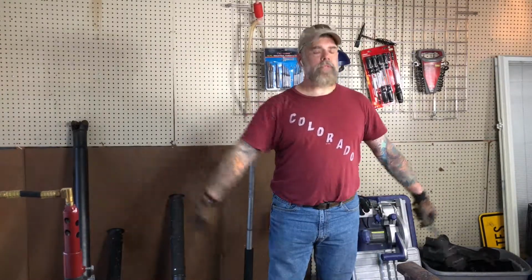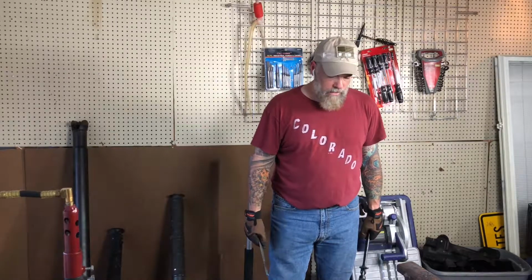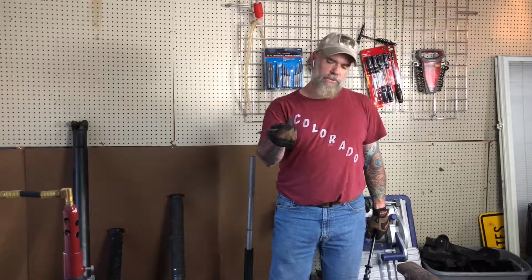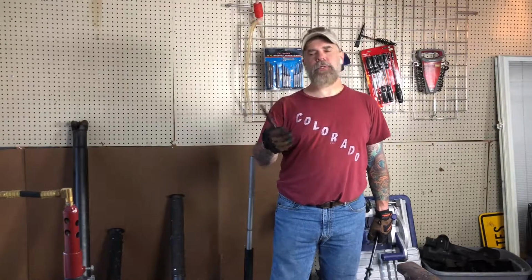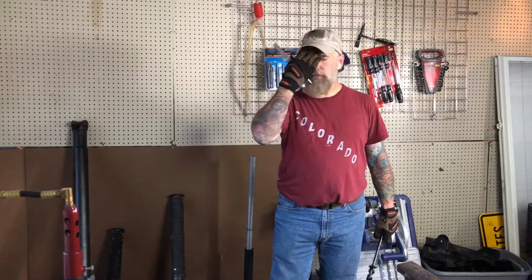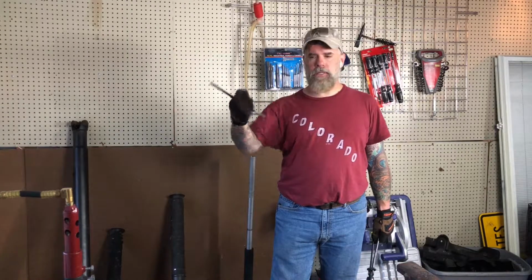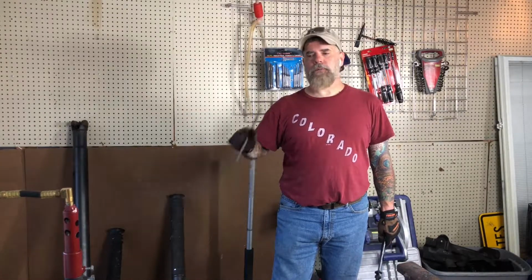So what we learned today? Initially, I learned that I got the forge set. I got the burner set so that they should be at the right height, and the flame coming out of the burner is good. I got the right pressure. I got the right amount of oxygen being mixed in with it. Everything is good on the forge.